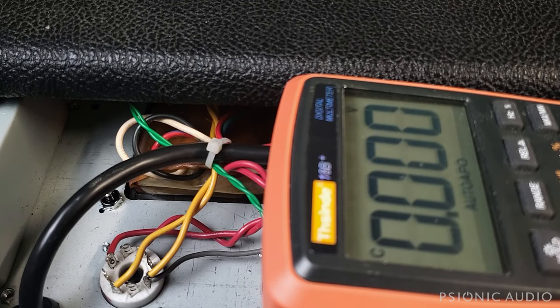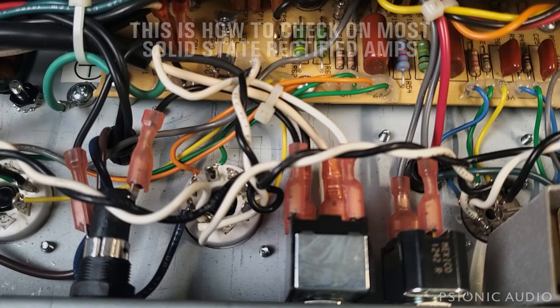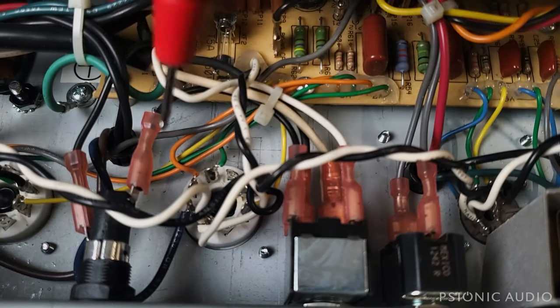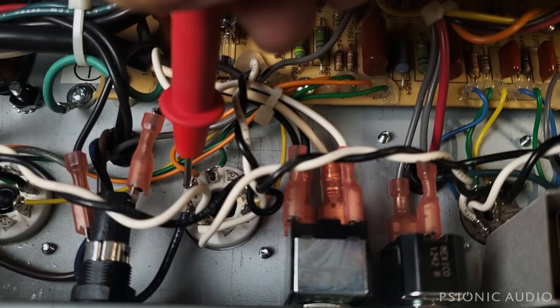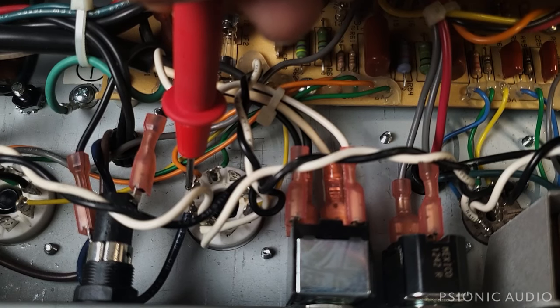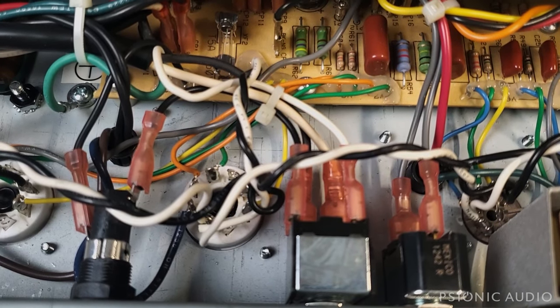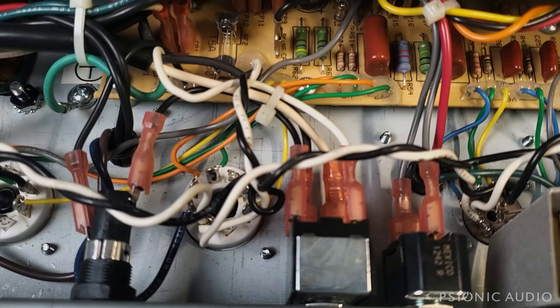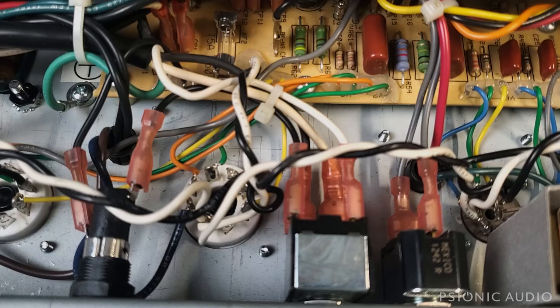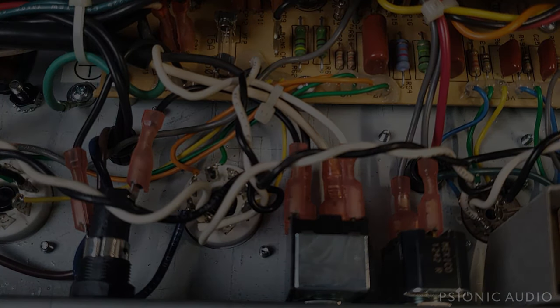If you have questions, you can find other places in the circuit to do the same thing — I'll show you a couple. This is actually useful to show because a Twin Reverb or other solid-state rectified reissue doesn't have that handy pin 8 on the rectifier tube. But what they do have is the orange wire on pin 4 of each output tube — that is the screen node. If you have voltage there with the amp out of standby, it's the same as having voltage on any of the other filter caps. We've got 1.88 volts, and it's actually going down now that the amp's been sitting. Through the meter there's a path to ground, so it is decreasing. We had two volts at the rectifier reservoir node and the same two volts at the screen node, now decreasing. So that shows how my quick-and-dirty discharge method can work and often does — but we also verified that before we pulled the chassis out and stuck our fingers in. Now I can take the chassis all the way out and look at things inside the amp.